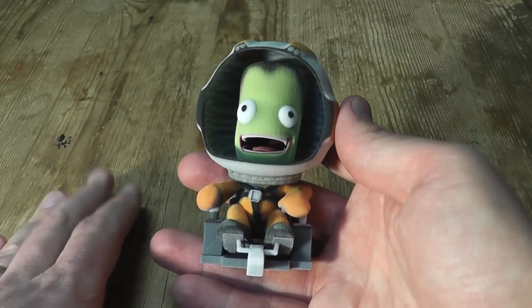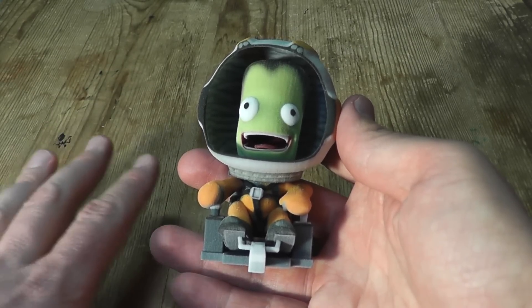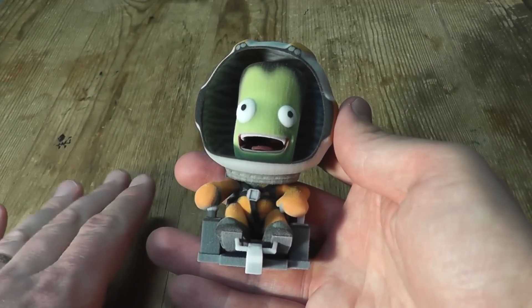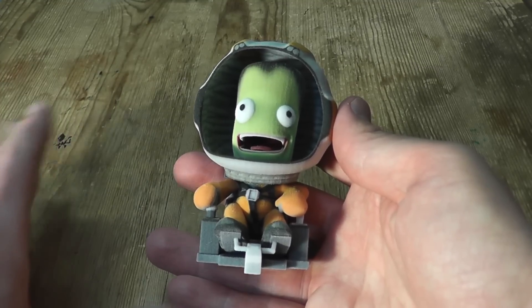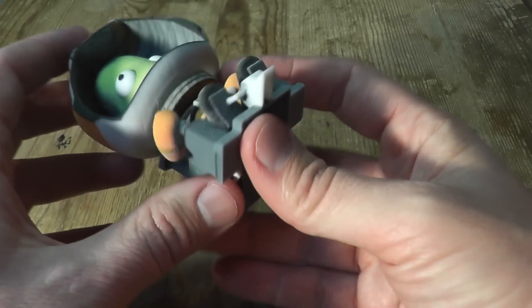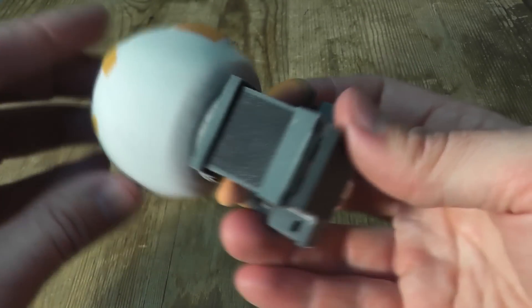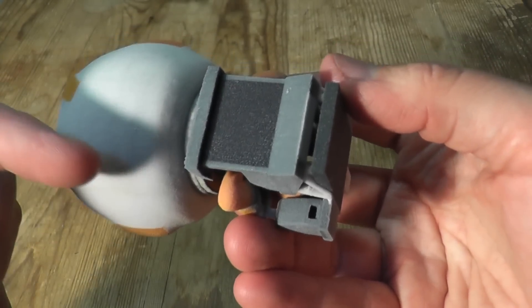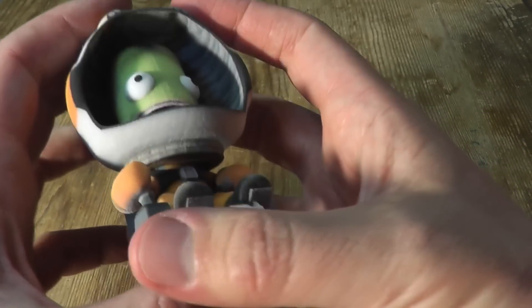The way the machine works, I believe, is you have a layer of this kind of gypsum powder. Then they do two-dimensional layers where they add colour and glue. Once they've let that set, they blow some more sandstone material over and then add another layer of glue and colour. They do it layer by layer until they make up the whole thing. If you look in there carefully, you might actually see that there are layers being formed. This has been built up layer by layer, slice by slice. I'm not sure if it was done vertically or horizontally — I suspect horizontally because that's where I'm seeing the ridges.